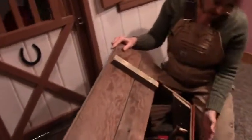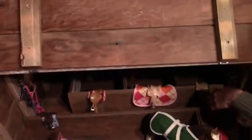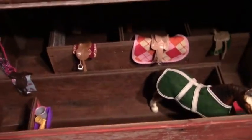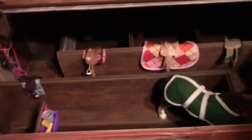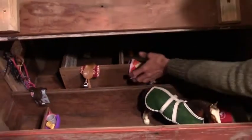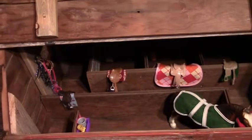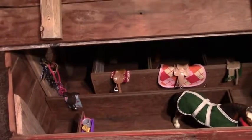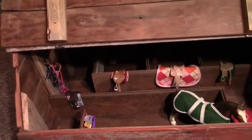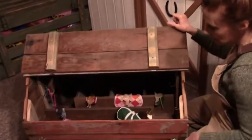It's pretty basic. You can come around to the inside, after you have the basics of your barn built, and start putting in your stalls. They're just screwed into the walls at first and then attached to some other piece you can screw into. I used 1½-inch star bit screws because they're nice and sturdy, but if you want it to look better you can use finished nails. I was concerned about it being really sturdy since it was such old wood.